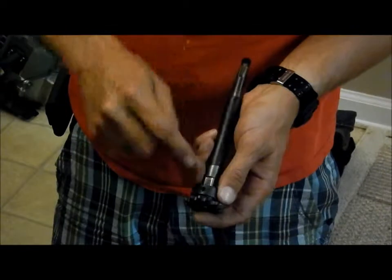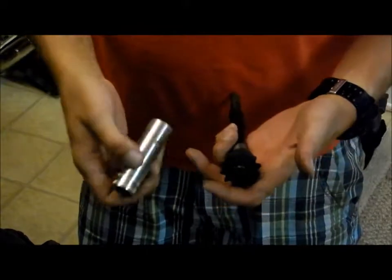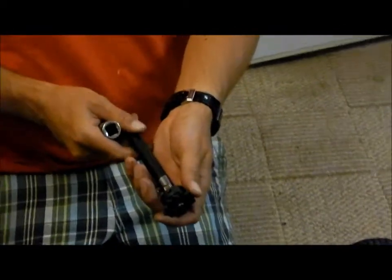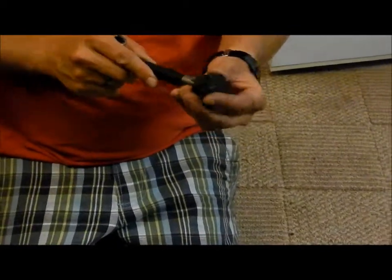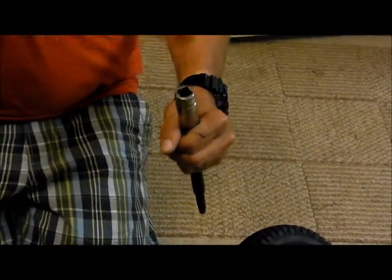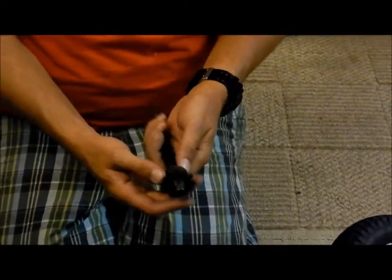You'll want to line up the set screw — it may be on the corner — line it up just in case. We found that taking a socket helps. In preparation for this video, to make the sprocket go on easily, because previously we had a hard time getting it on due to such a tight fit, we actually took a file and rubbed the sprocket mounting portion on the shaft, making sure there were no high edges, smoothing it up so the procedure would go easy. After doing so, it went on a lot easier and we were able to drive it on pretty much where needed.